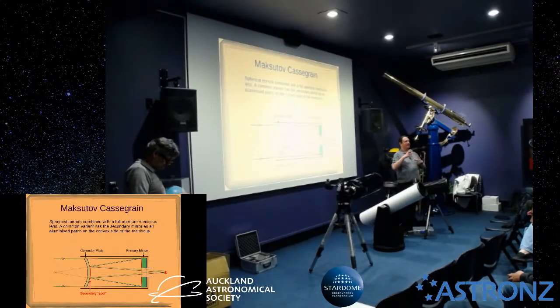It also depends on your adjustment of your mirror. The way that works is it's on some screws. If you loosen all of those screws and tighten all of the push screws, you're actually moving the mirror further in. So if you're not quite getting the focus, but almost, you can just adjust your collimation and push your mirror up. You might get to the end of your adjustment, but that is possible.